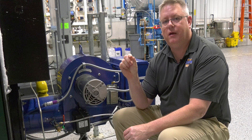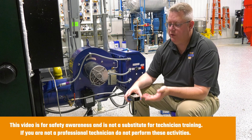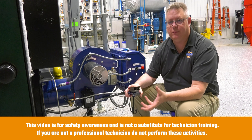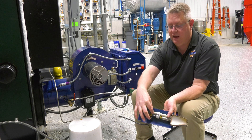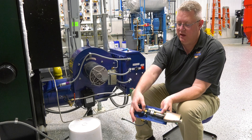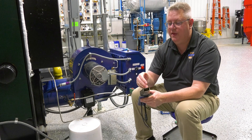If we've got a quarter-inch spark, then any gap between our electrode and the grounding surface inside the pilot that's less than a quarter inch will successfully generate a spark. Once we verify that we're generating a healthy spark, the next important thing is to make sure that the spark within the pilot arrangement is occurring where it's designed to be. We want to inspect the wiring going to our igniter and make sure we don't have wear, rubbing, or burn marks, because it could rub across brass and degrade the insulation, causing a spark where there's no fuel.